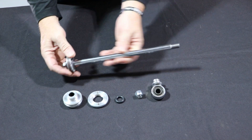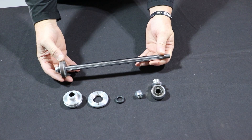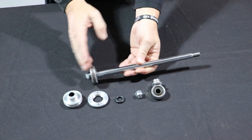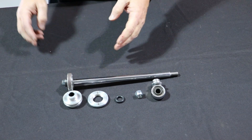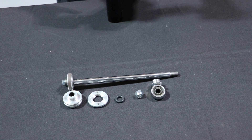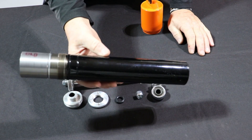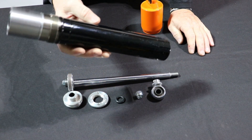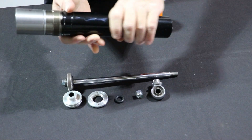And then the shaft — a seven-inch shaft or a nine-inch shaft. Then you go to the main piston, and you have your shims on your main piston for compression and rebound. Those are your main shims. The body of the shock can be different depending on what you get. This is a three-piece design.